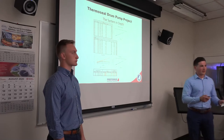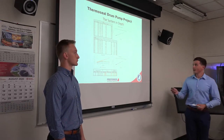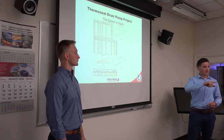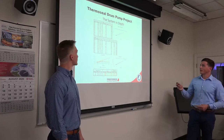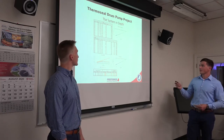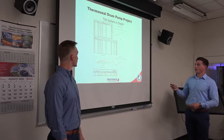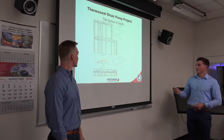And I formed a linear equation to that line. I noticed that it followed pretty closely to where the data point should be, but it wasn't exactly linear, so I plotted a polynomial to it. And then I also did the same thing for the female port, except with the O-ring outer diameter and the D dimension that I put on the last page.